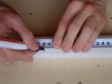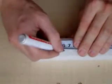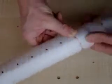The beam should fit in these holes. Make markings on the long foam beam every 30 millimeters and strip the insulation wire. Wind the wire tightly around the beam exactly over the markings you made, in a nice equal spiral.